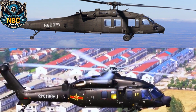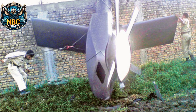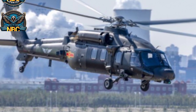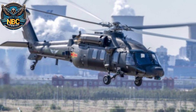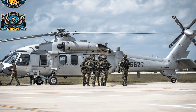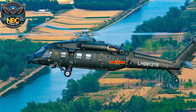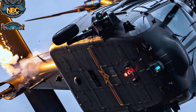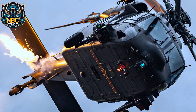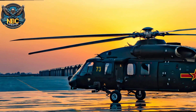The Z-20 is based on the Black Hawk, which the Chinese obtained in the 1980s. They may have also studied parts of a special Black Hawk that crashed in Pakistan in 2011 during the U.S. mission that killed Osama bin Laden. The Z-20 has some differences from the Black Hawk, though: it has five blades on the main rotor instead of four, a sharper shape on the tail and body for more speed and space, and devices on the back and top probably for satellite communications or the Chinese GPS system. It uses a Chinese engine with power similar to the latest Black Hawk engine, and features that make it lighter, stronger, and resistant to ice forming on the blades — helping it fly above 4,000 meters.